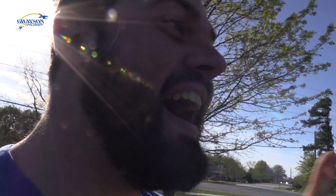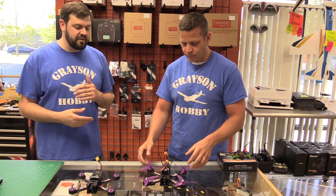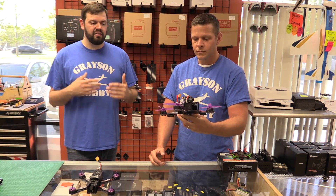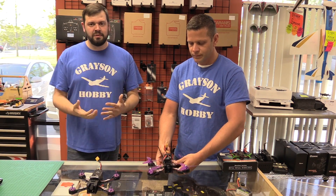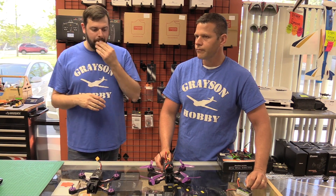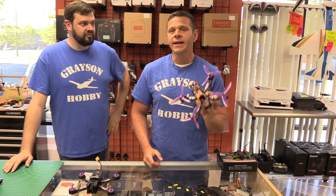Calibration — why do we need to calibrate? What's the problem? The wizards are set up — I calibrate the gyros, calibrate the accelerometers before they actually ship on the ready-to-fly models. However, if you crash a lot or something feels off — it's drifting — it's a simple procedure that can be done to make sure the gyros are leveled out and the accelerometers are neutralized, giving it a fresh start. Sometimes they do develop drift.